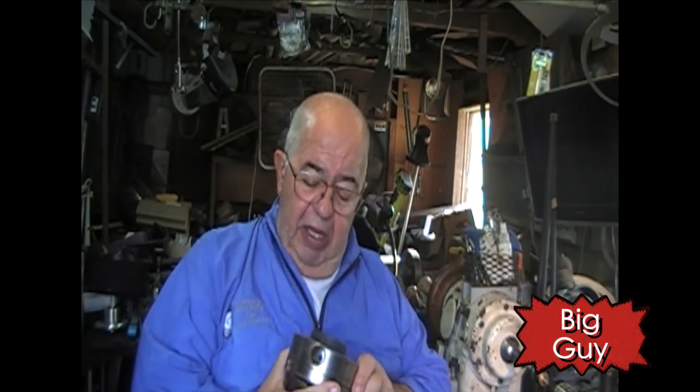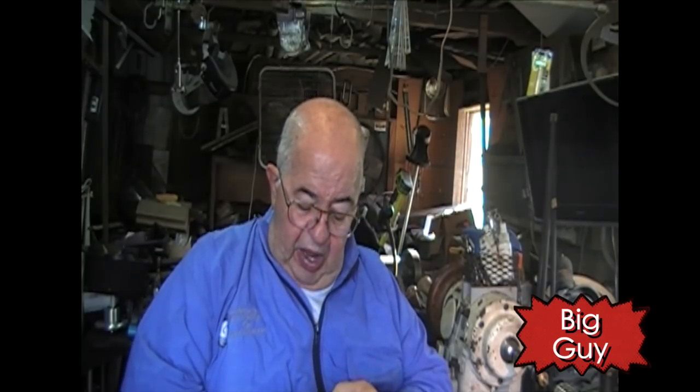But what I love about this chuck is one big C-lock ring down in there. I can pull this ring out, pop that ring off, and take all these parts out of this thing, clean it with mineral spirits, put it back together, and it's like it's brand new. And I had one sitting in the rain for a couple of years while I was away. It's like brand new. It just took about an hour to clean it and get it shaped up for what you pay for it. I got my money's worth out of that. Really did.